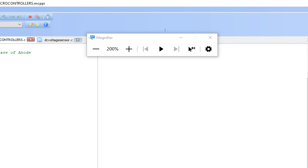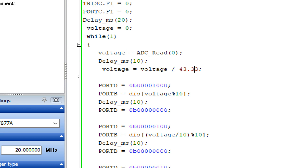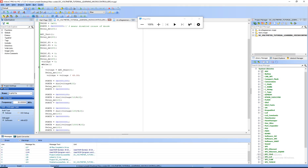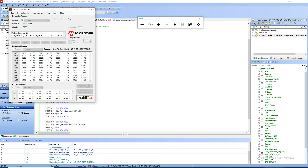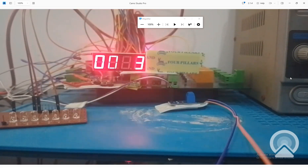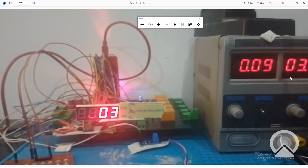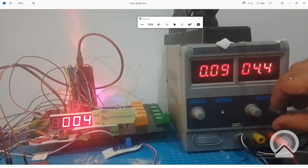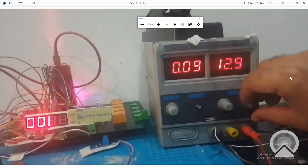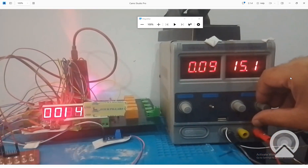The new code is written. Now it's showing proper values - at 3 volt it is showing 3, at 4 it shows 4, at 12 it shows 12. At 15 it shows like 14.9 something because we used an approximation for the calibration. You can use more precise values and play with the code - I will give you the MikroC for PIC files.